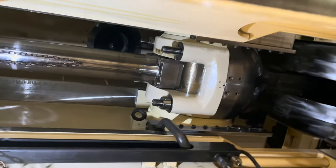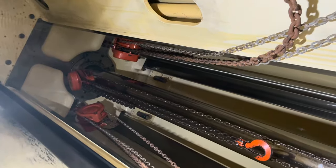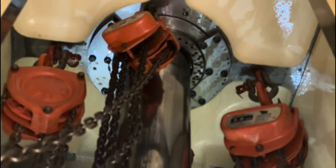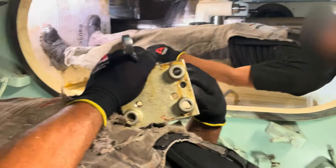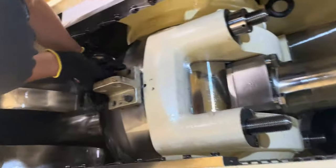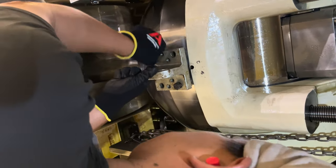Once 4 eye bolts and 4 D-shackles are connected, place the 4 chain blocks. The 2 outermost chain blocks should be of safe working load 2 tons and above to take the crosshead and piston weight. Then connect this tool to the connecting rod on both sides to keep the connecting rod in position. Then connect D-shackles and chain blocks on both sides of the crankcase door to keep the connecting rod in position. Then tighten the chain blocks on both sides equally so that the connecting rod will not move during the bearing renewal.